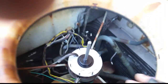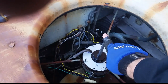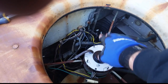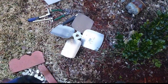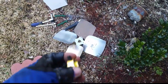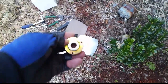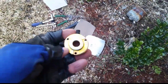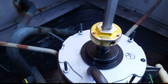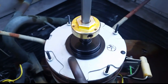I need to put the blade on and make sure the grille fits over this, because the shaft is a little longer than the motor that was here before, so I may have to cut it a little bit — hopefully I don't. On our aftermarket motor we have an aftermarket blade as well because it was fused together. Here's the hub for the blade — we'll put the hub on the shaft first and then the blade screws down to the hub. There are two flat edges on the shaft, so we have two set screws, one on either side.